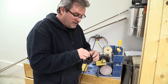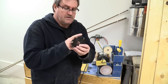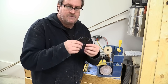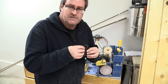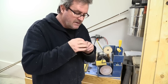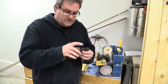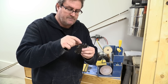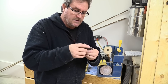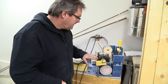I got it all cleaned up and had a look at the damage — it's pretty extensive. I was thinking originally I could just do the face, but it looks like I'm going to have to grind the tips of the teeth to get rid of the worst chipping, because a couple of them are almost flattened with the bevel completely chipped off. When you grind the teeth down, you also have to grind back the anti-kickback pawls by roughly the same amount.